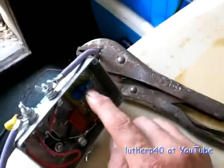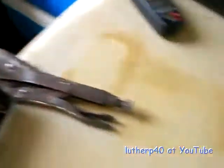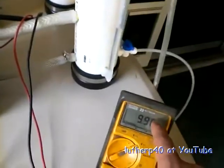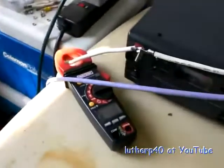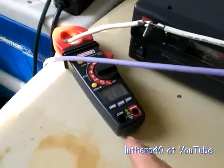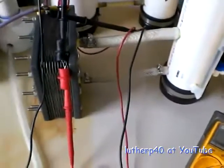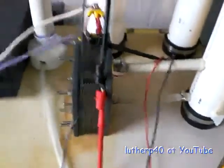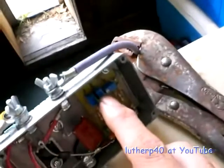I've come to understand that previously in the test I was using current limiting to set the cell voltage. The current limiting is what sets the maximum amount of current you want to allow to pass. So once it gets to 22 amps, it starts folding back even further and starts dropping the voltages on my cell and on my plates to reduce the amp draw. So current limiting is sort of the safety net.